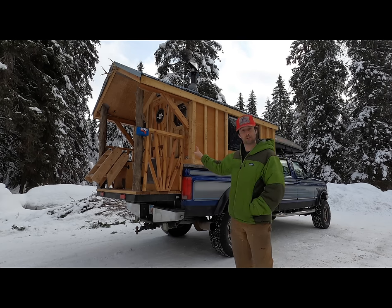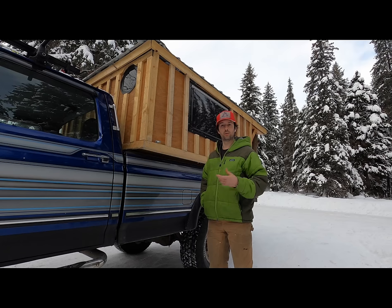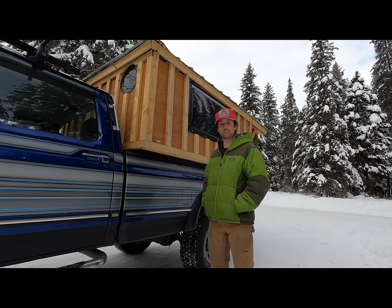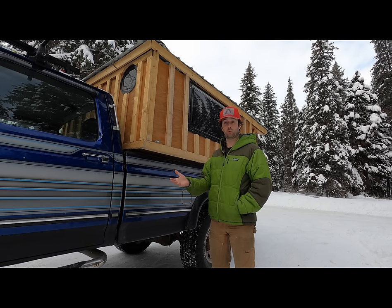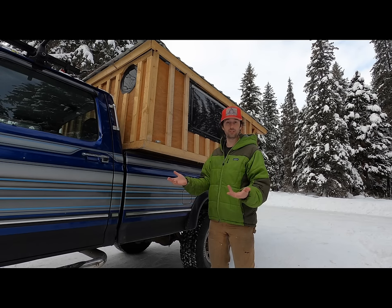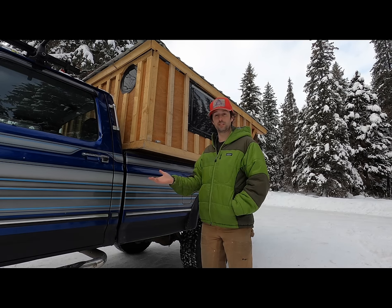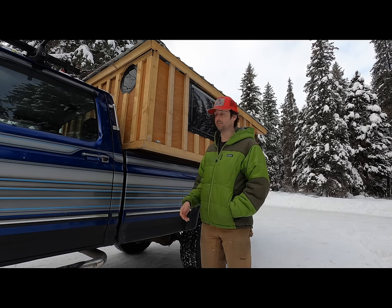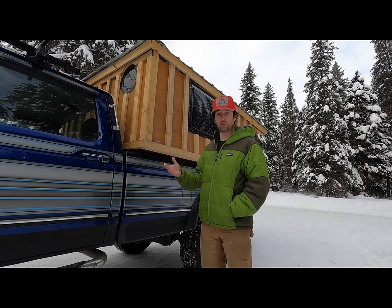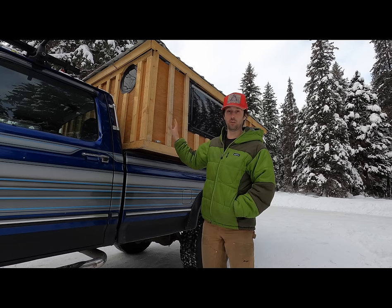To compensate for beefing up the corners, I used two by twos along the walls to help lighten things up. Another priority was a unique aesthetic. I really love the look of natural wood and wanted to keep that look for a few reasons. People all over the world work with wood, so if something happens while you're out there, you can find a general carpenter or do it yourself and fix the camper. To waterproof the wood, I did it just like you would do a wooden sailboat in the ocean — it's got varnish on it, essentially a waterproof gel coating. I use captain's varnish and do four coats all over the outside on all the wood.